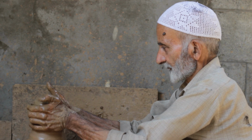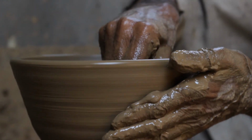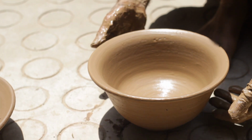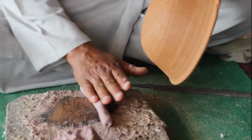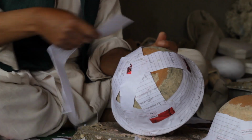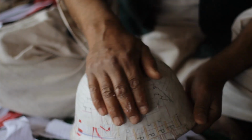It's the talent of the kumbhar, which means potter, that determines the beauty of the shape. The process begins with creating a hand-thrown clay mold in the desired shape. After it is fired, it goes to the sazi team. Each slow step in the sazi process adds to the overall strength of the bowl, making it durable, resistant to cracks, and uniformly smooth to touch.